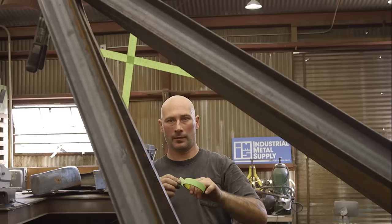In order to get these fenders to fit, I had to get an old engine just as a placeholder and install the steering column. I used the steering column out of the 69 cab from the donor chassis. We could replace this 70s style steering wheel with something more period correct later. I measured these fenders up front to rear — the clearances are cool, they're even, they're in place. I'm going to tack them on. The next challenge is getting these running boards in place — they need a pretty heavy support structure that has to tie into the frame.